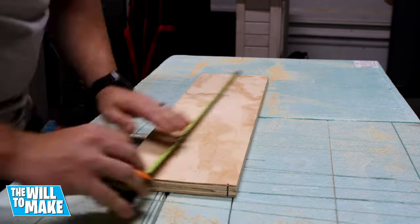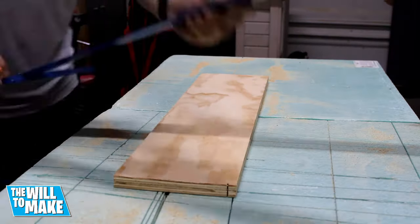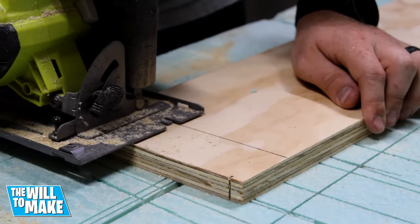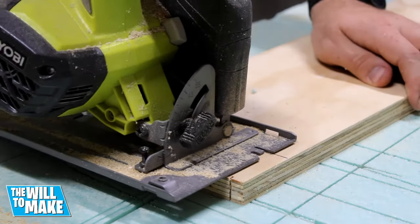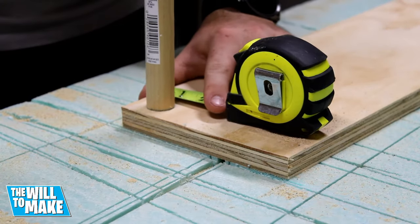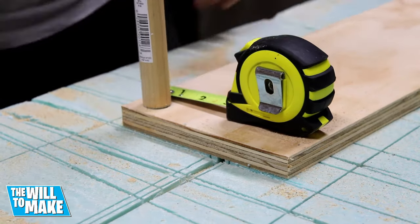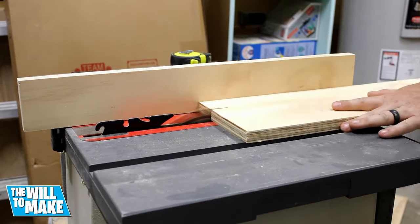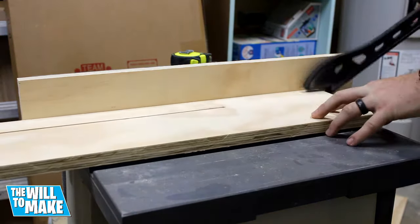Out of the cut off from the top I needed to cut three strips. I first cut the board to length so all my strips would be the same. These strips will be the apron on the stand. Using a dowel I planned on using, I measured how wide my strips would be for the apron, then ran the board through the table saw to get my three strips.